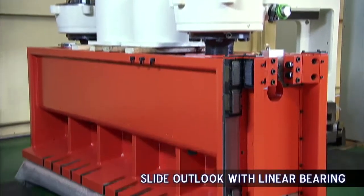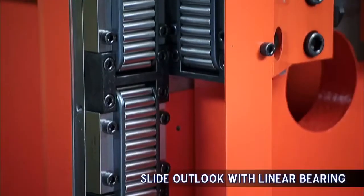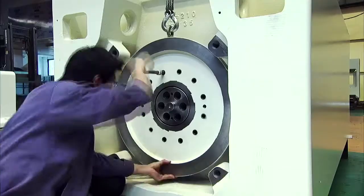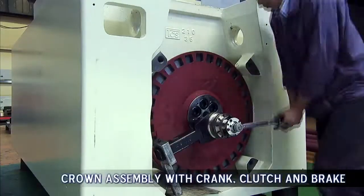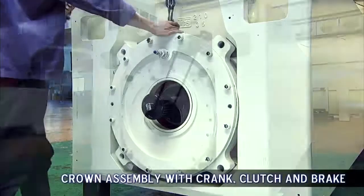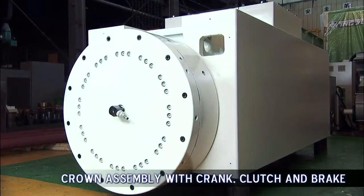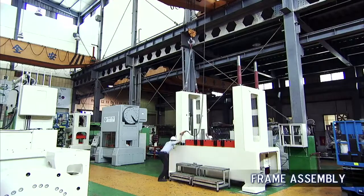Ensuring accuracy is key for final assembly. And during this process, INGYU engineers make a range of detailed checks and tests prior to the hand assembly of the clutch and brake into the crown. This allows us to ensure the performance of each module prior to lifting the crown into place, delivering optimum performance